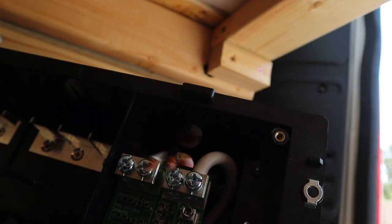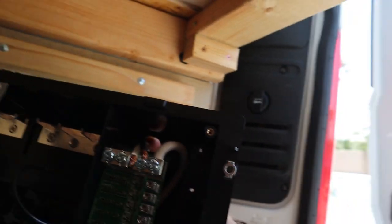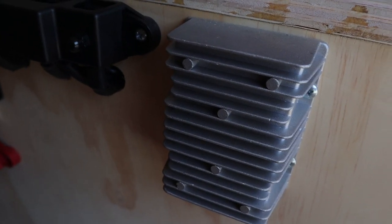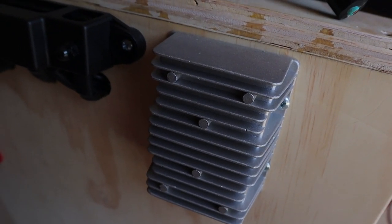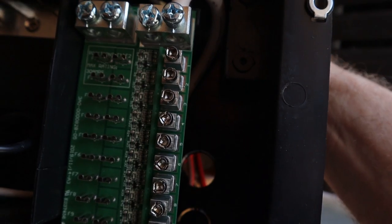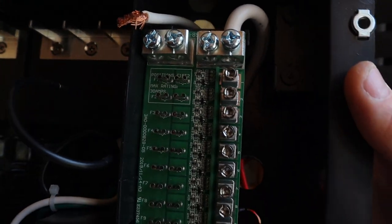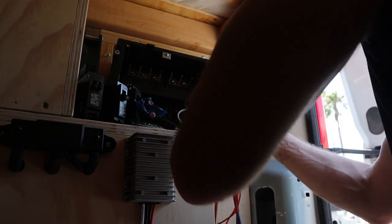This wire coming from the top is from your battery to supply power to the distribution panel. In my case it's actually my converter since I'm running a 24 volt battery — this is gonna down convert it from 24 volts to 12 volts. This is a 10 gauge wire and I'm only running 40 amps max, which is what the converter uses. Then I'm gonna feed through all of my DC appliances.